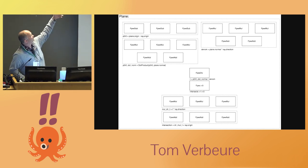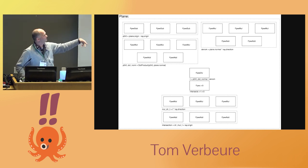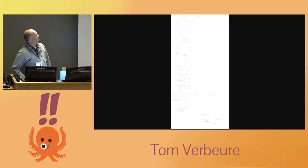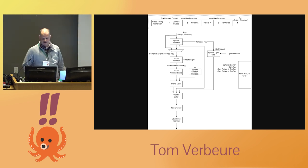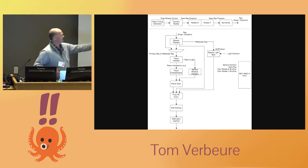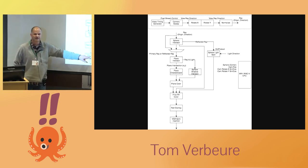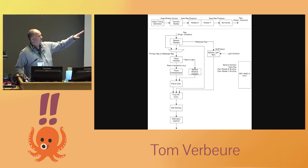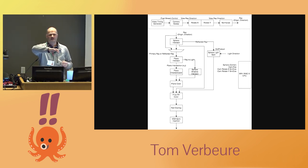Here's a quick walkthrough of the pipeline. The logic for plane intersection has scalar operations, dot products, and multiplications. A sphere intersection is a bit harder. Putting everything together, the total pipeline is about 115 floating-point operations and 85 clock cycles deep. In the block diagram, horizontally at the top I calculate all the rays sent into the scene, then from top to bottom: sphere intersection, plane intersection, light and shadow calculation. A text overlay adds some marketing info, and the output goes to the chip. On the right there's a small RISC-V CPU that calculates once per frame — just the next camera position.